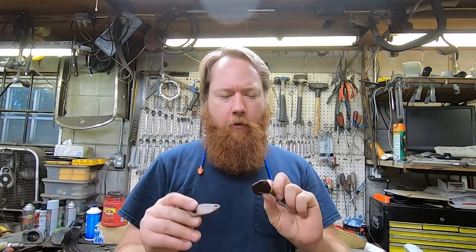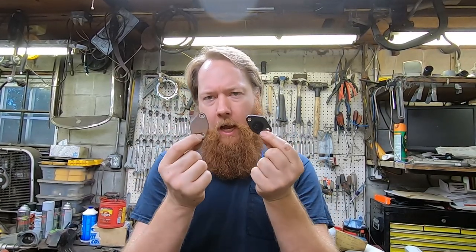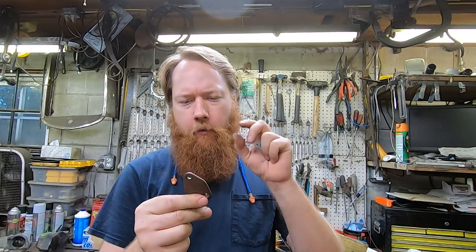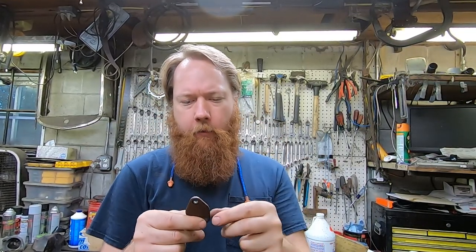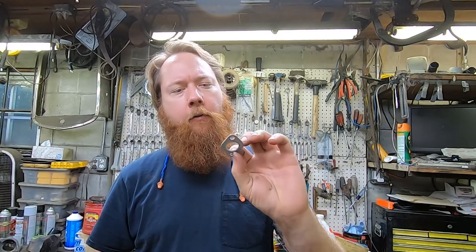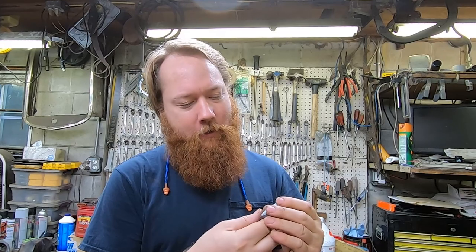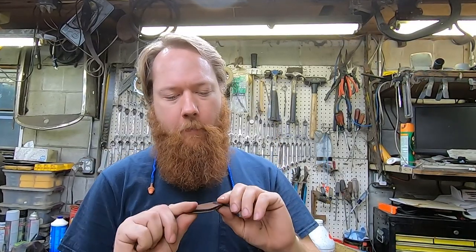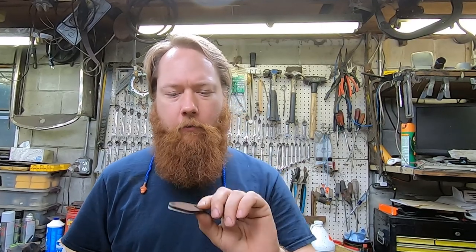The zinc coating, or the galvanization, needs to be eaten off of that conduit, so we'll work on something else. I've got the old block-off plates. I want to drill holes through them so the conduit can fit down into them, and I'll weld it from the bottom side. And I got some gaskets here that I think are dimensionally correct, and we'll set these on here to draw our marks. So we're going to modify these things to be used as flanges for the heat riser.